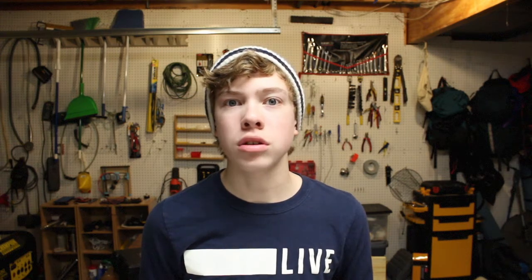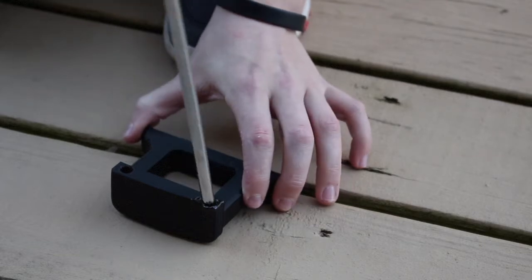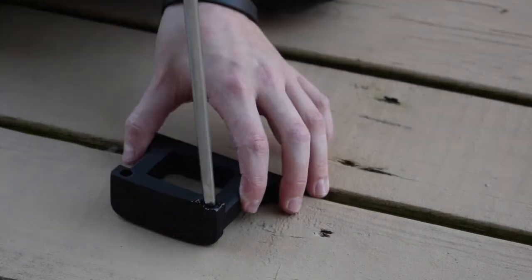Alright, so I have the parts printed. I designed two different parts for this project: one is the end cap — I printed two of these to hold both sides of the linear rods — and then the actual carriage, which attaches to the bearings and holds the camera. These turned out pretty well. They actually fit on my first try, which is like a record on this channel. Well, almost — it took a little modification. You can download these models via the Thingiverse link in the description.